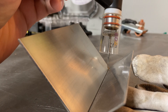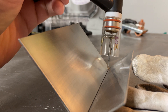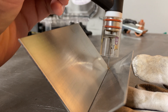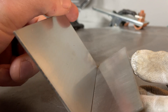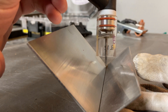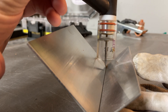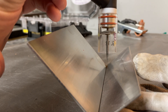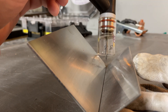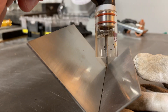By tilting it like this, you have equal gravity pulling on each side, which keeps it simpler when you're first learning. Our goal is to keep the tungsten pointing relatively straight up and down — not leaning more to one side than the other — so the valley of the weld stays even on both sides. We're going to have a little bit of a push angle because our direction of travel is coming towards us, and I'm going to do a quick stop in the middle, then tie in and continue to the end.